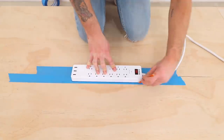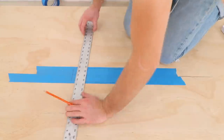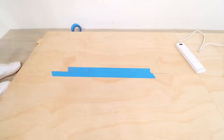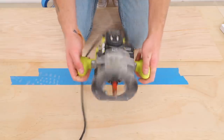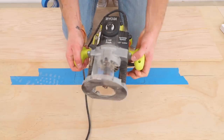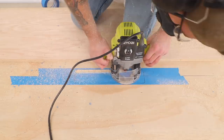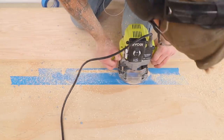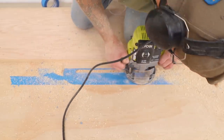These are the power strips I'll be integrating into the tabletops — nothing special. To keep with the theme of accessibility and affordability, I found some clean white power strips on Amazon that would traditionally go under a desk or behind a TV. I'll be using my plunge router along with a three-quarter inch double flute straight bit to cut all of my recesses. I used a straight edge to maintain consistent lines and made each cut in three passes so I wasn't doing too much at once.